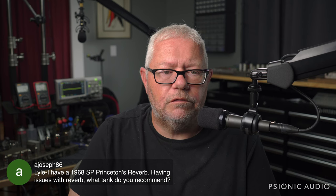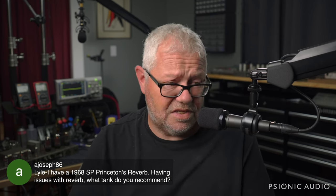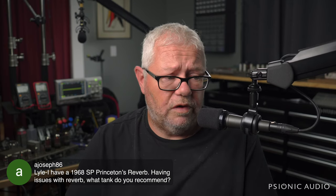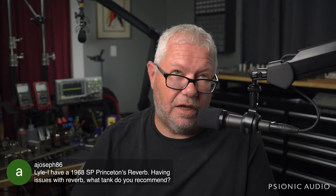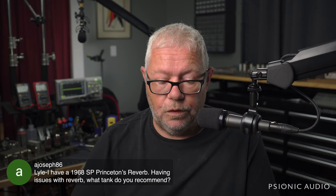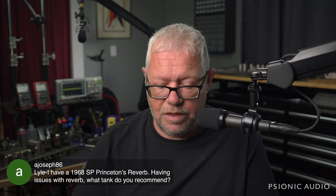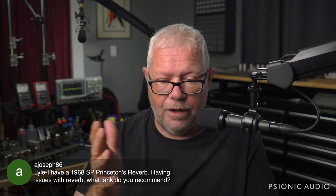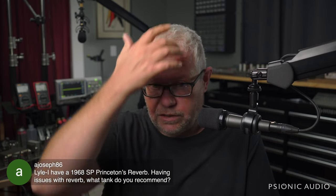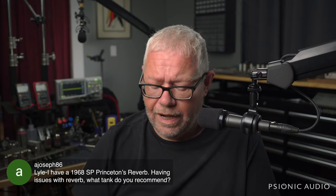Hey, A. Joseph 86, of the tanks on the market today, he says a '68 Princeton Reverb having issues with the reverb. What tank do I recommend? Of the tanks on the market today, I most like the Mojo Tone Medium Decay. Not the long decay, it's the medium decay. And the medium decay Mojo Tone sounds, both in duration and tonality, more like the old Gibbs Accutronics long decays from the '60s.